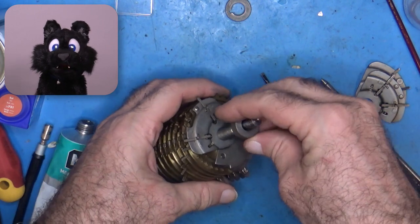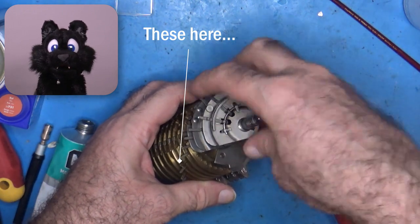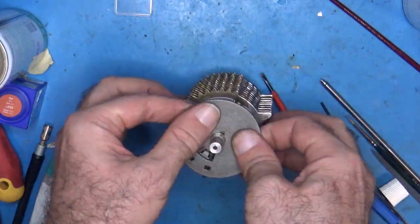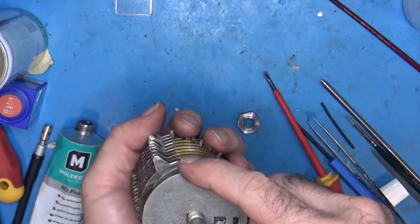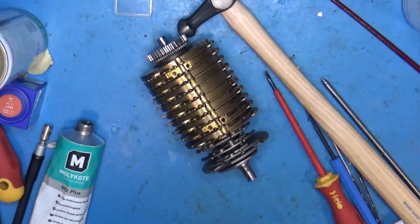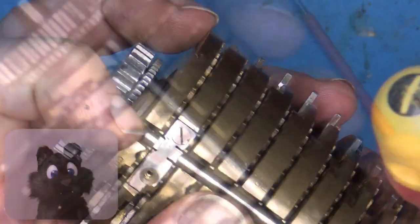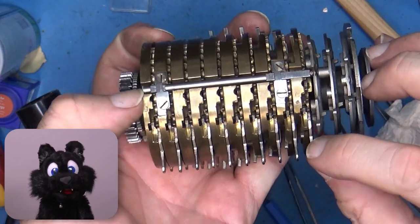Each ring has a pair of spring-loaded levers too. These are for the carry mechanism and make each wheel unique in its position on the drum, since they are staggered so that the carry can propagate. Side note, I had to remove the grease from these parts later, it was just slightly too sticky.